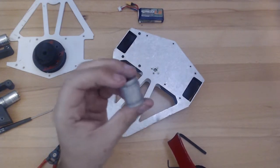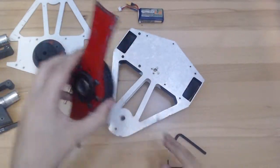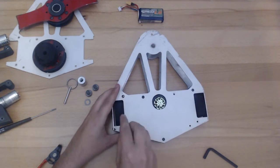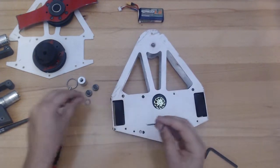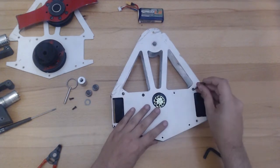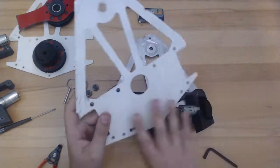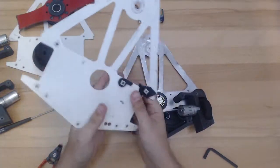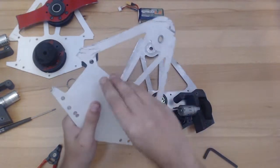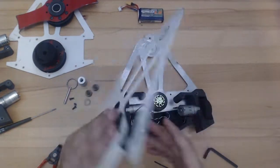There's the aluminum spacer that the needle bearing runs on — it came out with no marks on it. The AR500 bar came out pretty good. As you can see, the motor there is a little bit loose, because the screws are already out of it. That screw right there has the head machined off. But taking it off isn't going to be a problem because that part actually delaminated. Instead of using embedded fasteners for the production kit of the Vector, I'm going to do hexagonal standoffs that run all the way through the part.